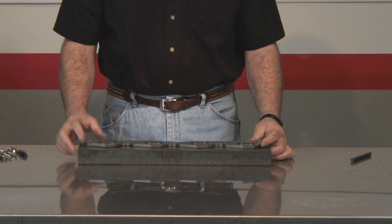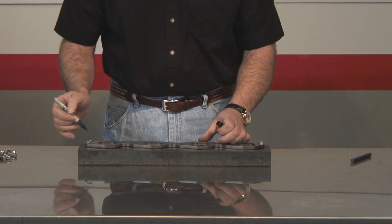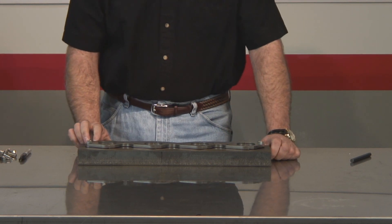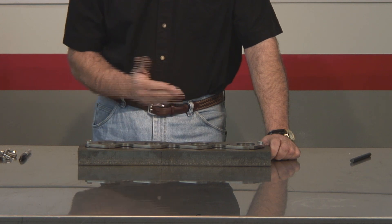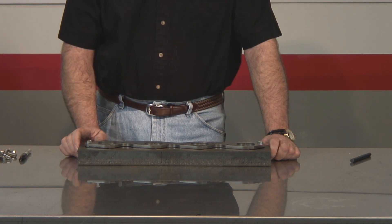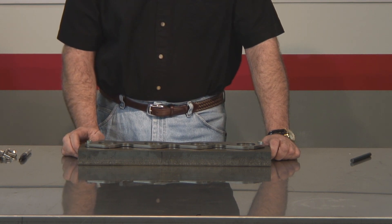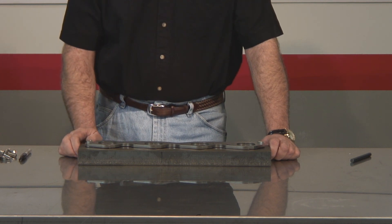That way you drill the rest of the holes, but before you pull that flange off, you're going to want to trace the perimeter of the flange with a Sharpie, plus the port holes. The reason is every one of these flanges is unique — every model has a unique position. You can flip it over and it can be off so subtly that you don't see it, but it'll be off just enough that you build a header that won't be any good when it's done. Being off just a little bit on the port or the bolt holes will make a poor header, so keep in mind that drawing is extremely important.